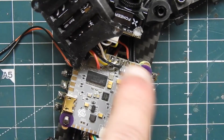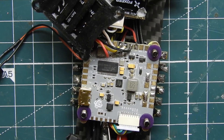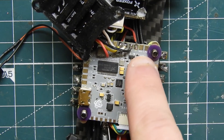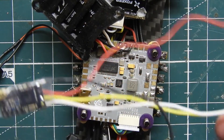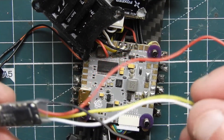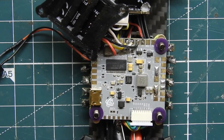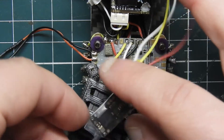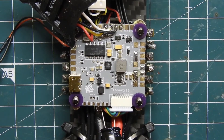I did notice I messed up a little — I wired the 5-volt to the camera and cut the wire too short, so now I'll use the receiver power rail instead. Now for the Crossfire receiver — if you're using a FrSky receiver you'll use the SBUS pad right there, that's the only difference. I'm using two extra wires using a receive port and a transmit. With SBUS you'd just have three wires: power, ground, and SBUS. I'm pretty sure I'm going to mount this on top of the flight controller. Let me shorten these wires up and I'll be right back.